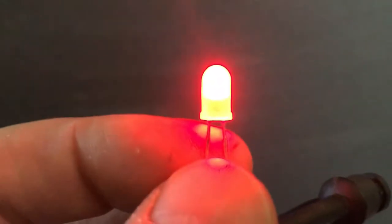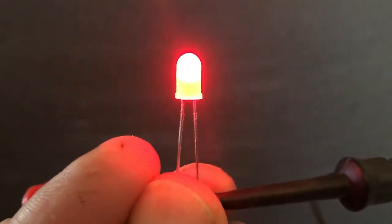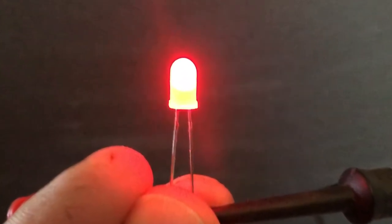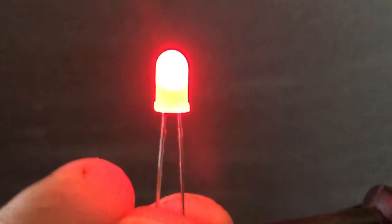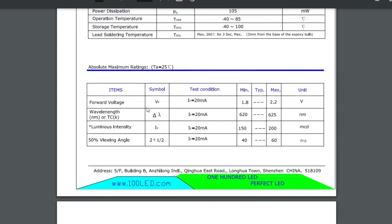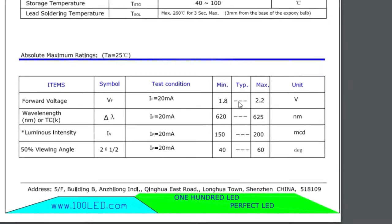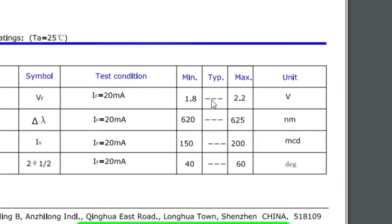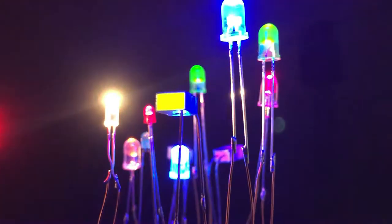This is a common inexpensive red LED. I got it from SparkFun — the link is down in the description. LED stands for light emitting diode, but you don't need to know that. What you do need to know is what voltage your LED likes to run at. This LED runs at two volts. This is the spec sheet from the manufacturer through SparkFun. The forward voltage is what to look for — two volts. Two volts is the best voltage to run this LED at. More than two volts and it will overheat and burn out. Less than two volts and it won't be bright or turn on at all. Different color and size LEDs will have different forward voltages, so always refer to the spec sheet forward voltage number.